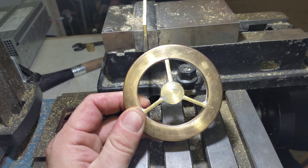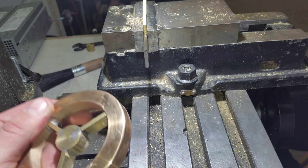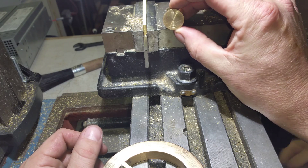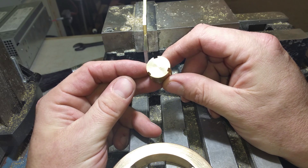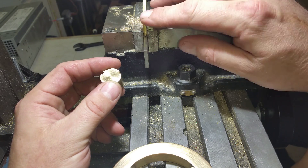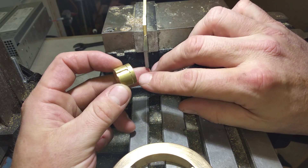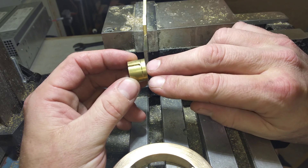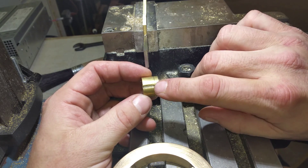The caster is on the truck for delivery today and if everything goes our way we'll actually be doing some brass casting today. We've created the hub and marked lines at 120 degrees, then milled out three sections at 120 degrees — so these are the three spokes here. They're a little crooked, but we're going to machine them straight and flat for the back side. Because the router bit left a curve, and because it will be easier to come out of the mold, we're going to round the nose of these — it'll give a nice aesthetic effect.